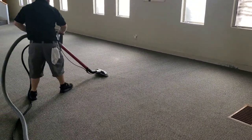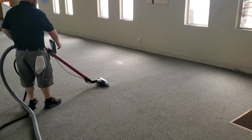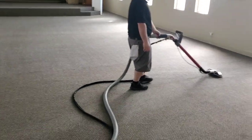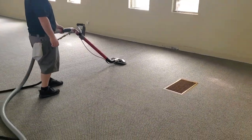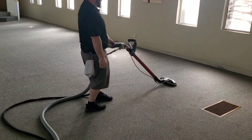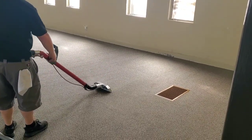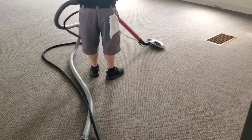We're running up to 20-inch lift and 600 CFM with this TMF ProFire from Steam Action. Ever since having it, I don't think I'll get anything different — it's been a great machine. If it weren't for having to watch the van, Adam and I would dual wand this and we'd probably have been done 45 minutes ago. But they had this really set up for us — all the pews out, everything cleared, and they even vacuumed for us. So we just came in, pre-treated half, rinsed it out, pre-treated the other section, and started rinsing. Super easy.